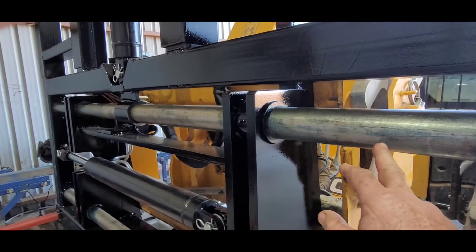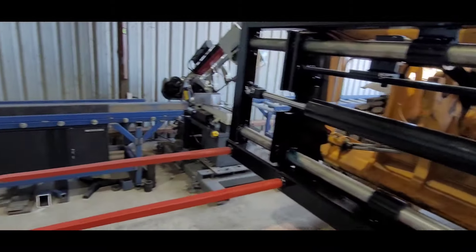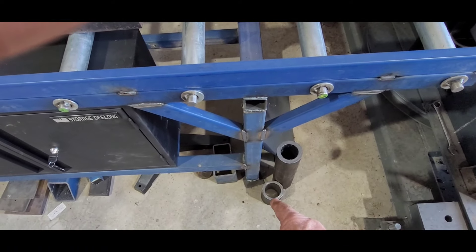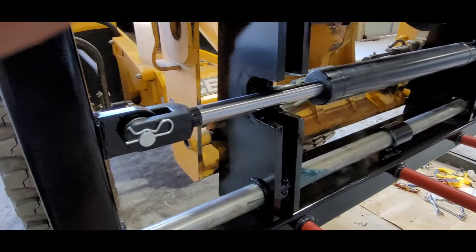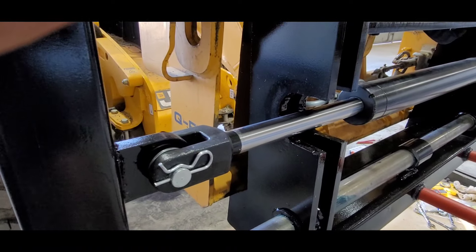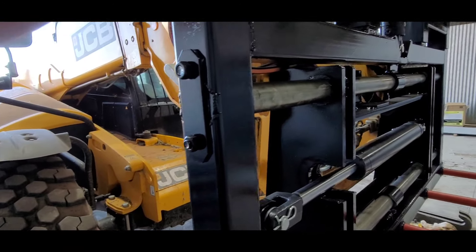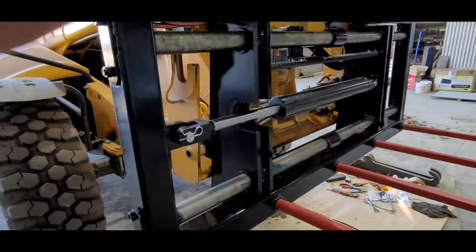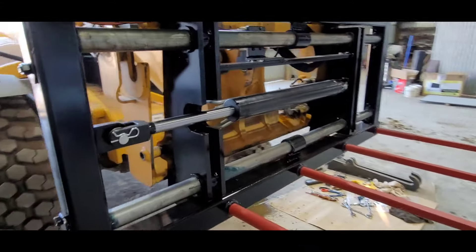I was a little bit worried that was not going to work because everything is a rather tight fit. I've used solid 4140 high tensile — tool steel virtually. I used hollow bar to make the bushes which I had to machine out to round about that size — that was a dodgy one so I made another one. Welded to the JCB bracket lugs, cut out for it all to slide through. That 4140 is extremely heavy, so I've made it so that you can unbolt it from either end and slide it out if you ever had to.